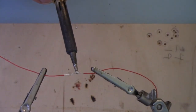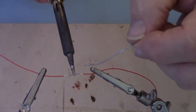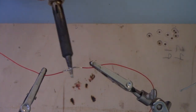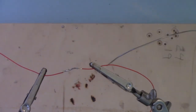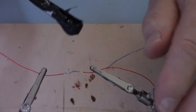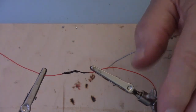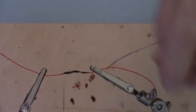I'm going to put the iron underneath the wire, give it a couple of seconds to warm up, and then — I had enough solder on there — you can see it just flowing right across there. A little extra solder wherever we need it. I'll get that extra solder off, then add a little bit of solder to the tip just before I put it down onto the holder. Now we can come back with the liquid tape and just lightly brush it across here, getting it on both sides. We've got it nicely coated all around. Let it dry and we've got that wire.